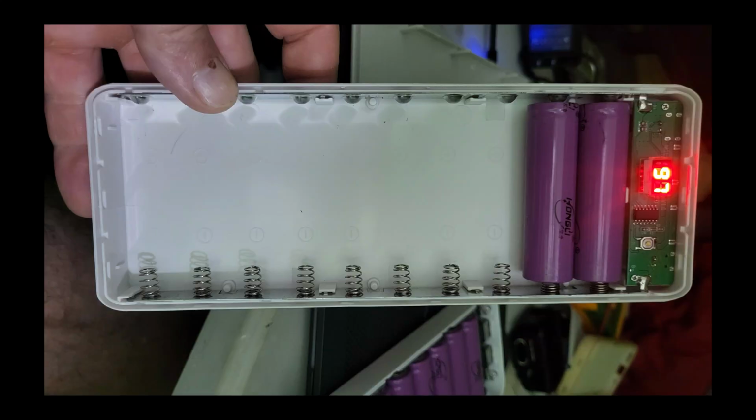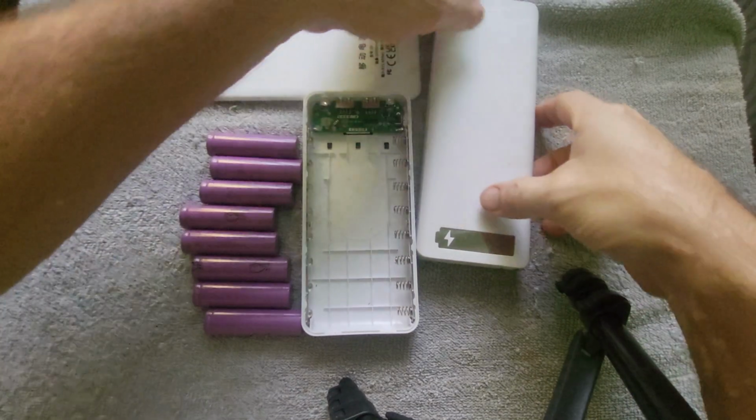Okay, so important here, this is worth noting. You see the battery bank in the picture says it is 97% charged when there's only 2 batteries in it. The thing with this is it's only reading the voltage. So it's 1 battery or all the way full. It's not reading the capacity. It's just reading the voltage. So it's misleading as far as the capacity or how full it is. It's really just how full the batteries are there.